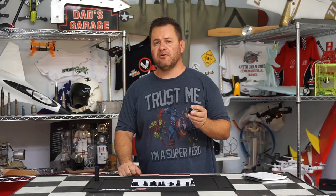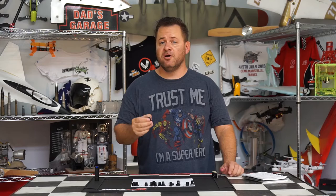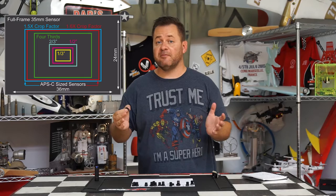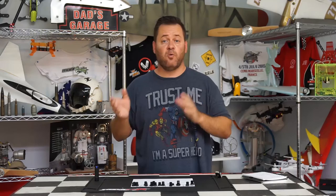Let's start at the core of your FPV system — your FPV camera and its sensor. Most standardized FPV cameras in the 1177 size use what's called a one-third sensor. But remember, these M12 lenses that we're utilizing came from the security camera business, which meant there was a wide range of sensors available — from one-fifth all the way down to a quarter and everything in between. So if you order the wrong lens for a one-third camera, two things are going to happen: you're either going to get vignetting around the outside of your image, or you're going to have a crop factor, meaning the light coming in was actually bigger than your sensor.